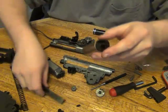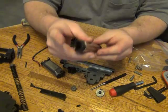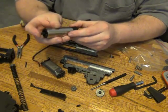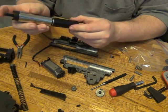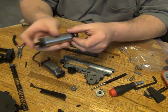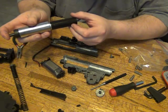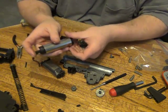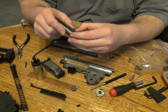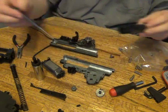And you don't need the tap-up plate for this test. Basically, now you hold the front end of the air nozzle again and just push. There is no compression. See how fast and easy I can do that? It's probably because the O-ring is slightly smaller. How crappy is that? Well, I have a thing for that when this happens.